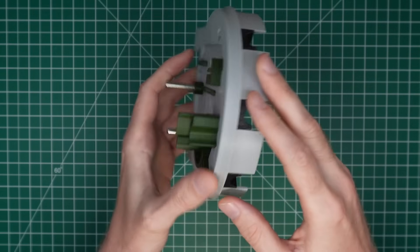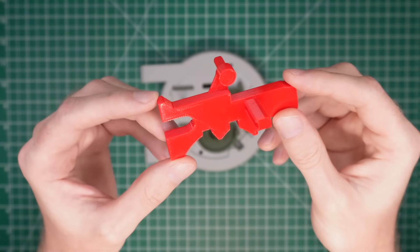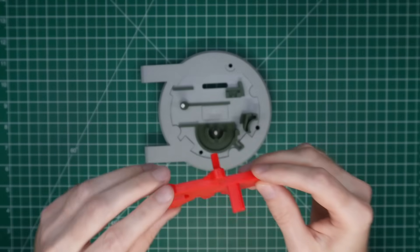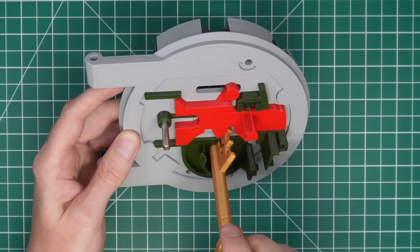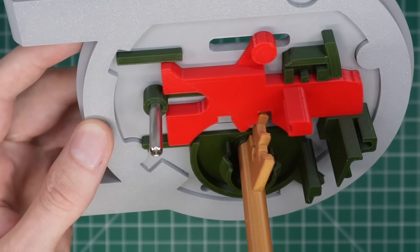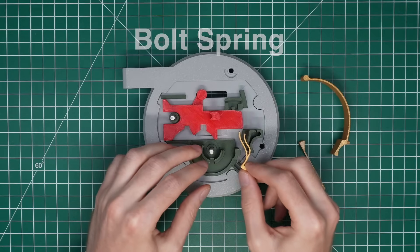The core of the door is now complete, and next I'll begin assembling the lock. The bolt is added first, and this has a small pin on the back which I glued together earlier. When we turn the key, it pushes the bolt back and forth, and the pin on the back transfers this motion to the vault mechanism. The bolt spring is added next.